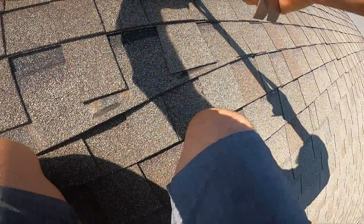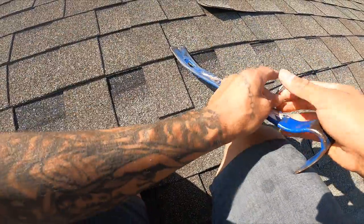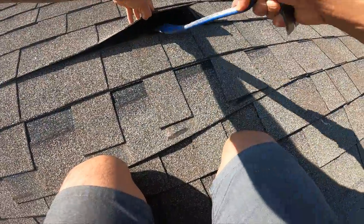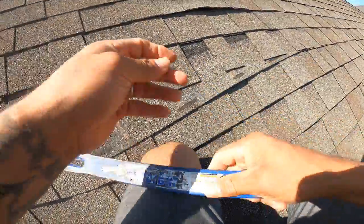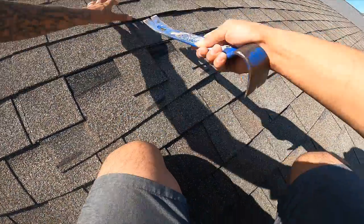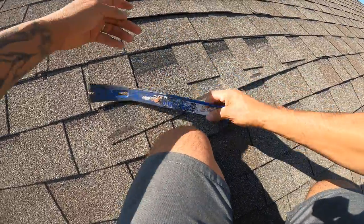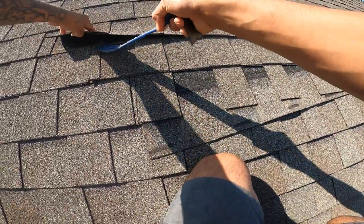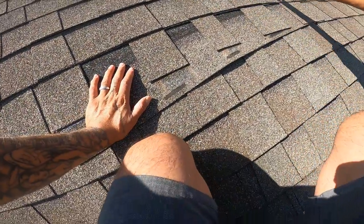As you can see right here, I have the curl bar — I just go like this and take them out. We do the same thing right here, and you've got to excuse my movement because it's a pretty steep roof and these shingles have too much granule — they can get really slippery. We've got another nail here, but that doesn't matter because this shingle goes straight right here all the way over, so we're going to check for another nail on this side.